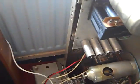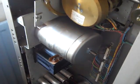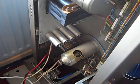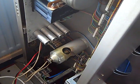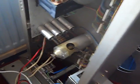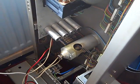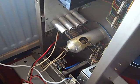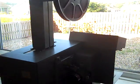And this would have obviously used an external DC source to power that, which unfortunately we don't have up to now. So I think I'm going to have to build one. I will take the remains of a moving light, a Martin Mac moving light that I've got lying around, which has a suitable transformer in it. I'll have to build that into a little safety box, which will give us our high voltage starting arc, and it will give us our low voltage high current DC. So with that up and running, we should be able to get the lamp to strike, and as we've seen already, we have audio, we have mechanical movement. As soon as we have that, we should have a fully working vintage 1960s cinema projector.